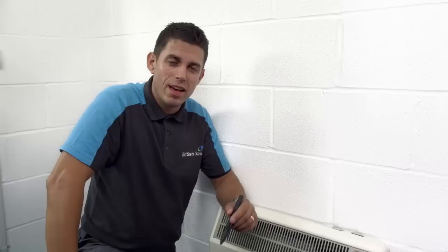Let's have a look at the input. This controls how much heat you store overnight. The best thing is to adapt this to the temperature outside. In spring, summer and autumn, try different input settings to see how much heat you'll need to store to stay nice and warm through the day. Some rooms may need less than others, and there may be moments when you won't be using heating at all. If that's the case, just switch off the whole heater at the wall.